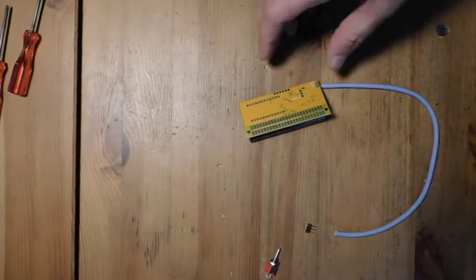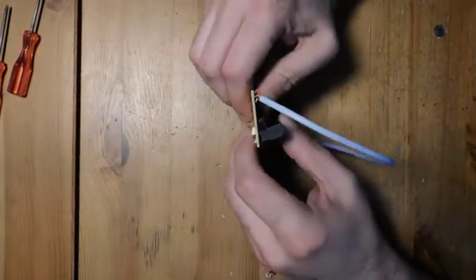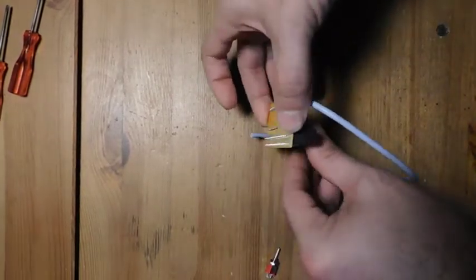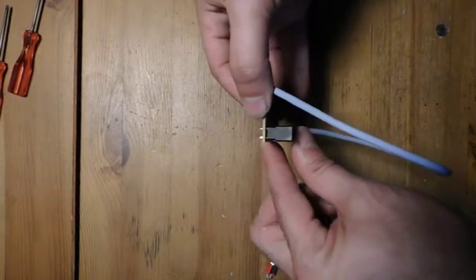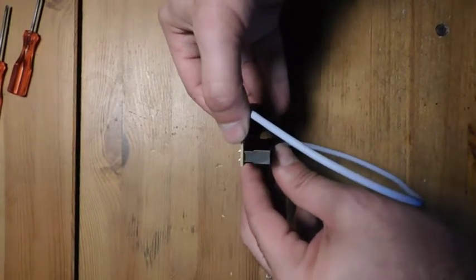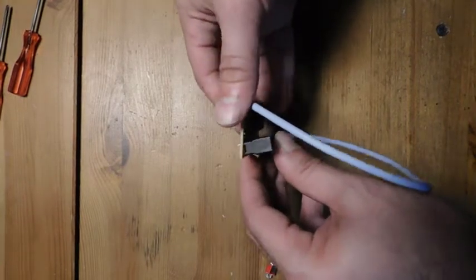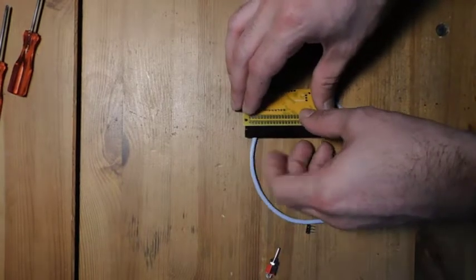All right, so we've got our FM board here, and the first thing we've got to do is plug this edge connector in, and this is going to make a direct connection on the back of the Master System. You just literally pop this thing in, so it's really not that difficult. One thing though is that you don't want to solder in this connector perpendicular like this, and that has to do with the shape of the Master System's case. It's sloped, so this will bump up against the top and it won't fit. So you actually have to put it at an angle like this and then solder everything into position.